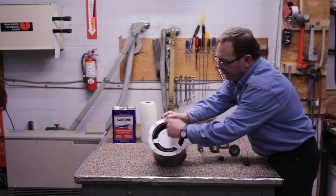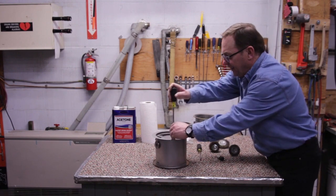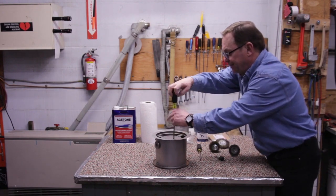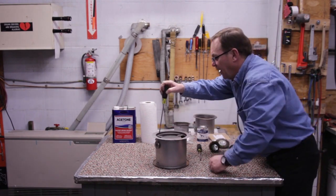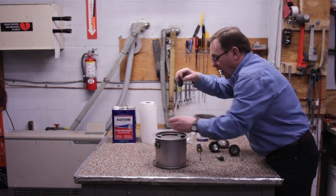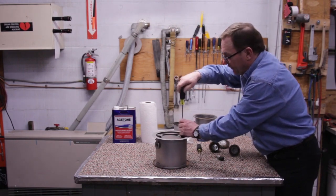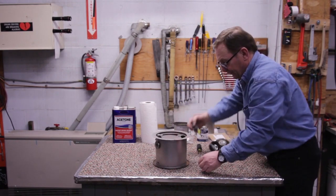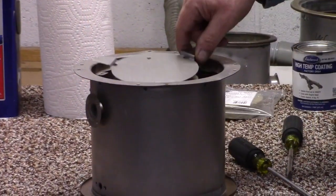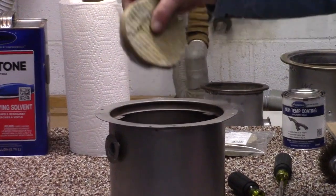We have 3 screws down here that are holding our burner insulation pad on there. We're going to go ahead and take those 3 screws out of there. And we're going to inspect this insulation pad down below on this product, and we're also going to check the bottom out to make sure that the bottom looks good to go ahead and do this with. So here I've removed my 3 screws, take my plate off, and here's my insulator pad right here that I'm pulling off my hand.